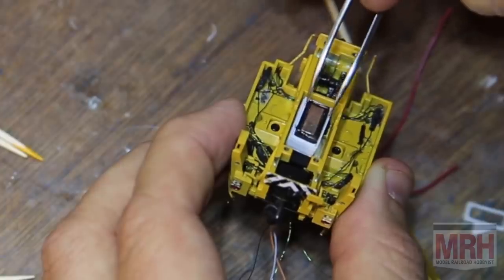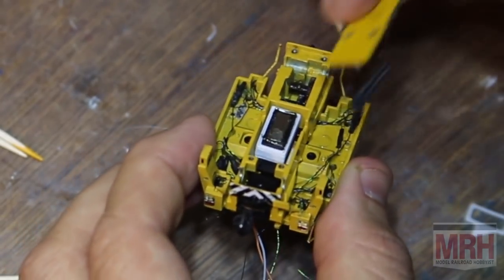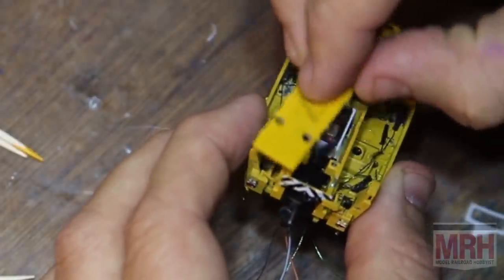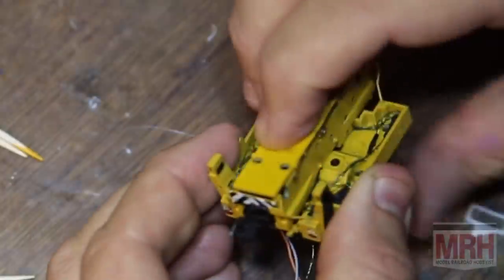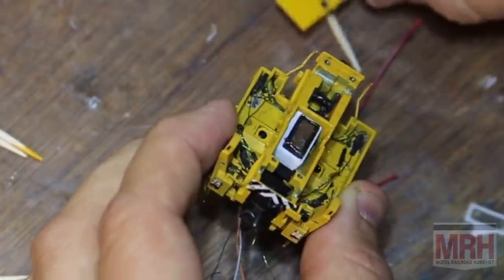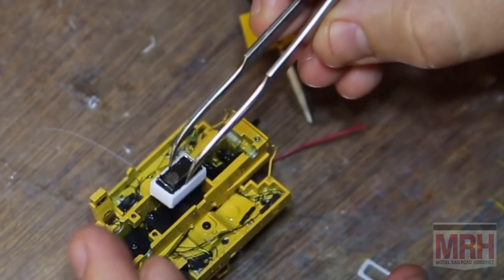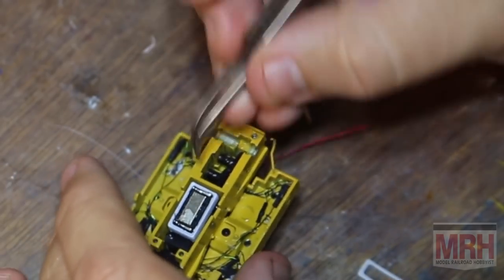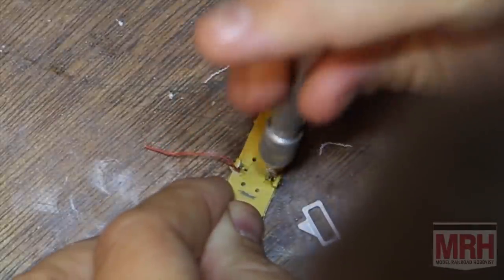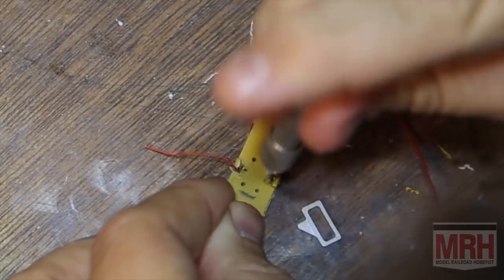The baffle came out to be exact in its dimensions. So precise that when I press fit the speaker to it, the fitting was so snug that no adhesive or additional measures to seal the fit were required. The assembled speaker itself was a perfect fit for the available space. So I used double-sided tape to attach the speaker box to the back of the decoder bay on the Trackmobile. I then perforated the plastic bottom of the bay with a number 68 drill.